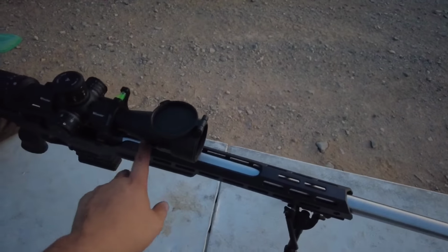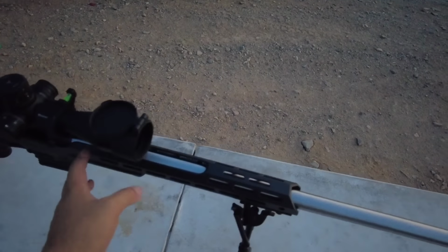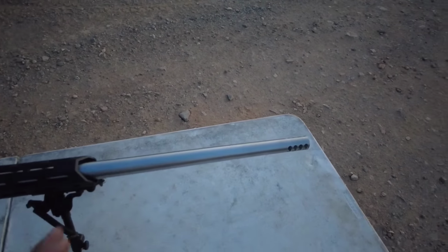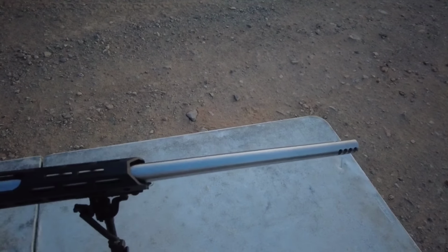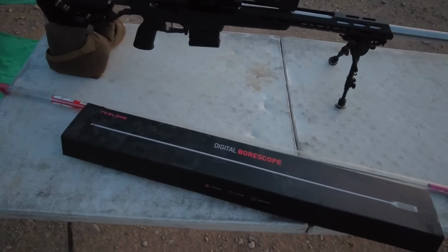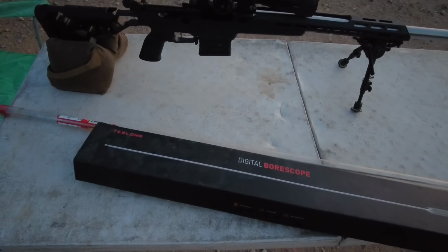So you should see a little bit of copper fouling within, obviously, the throat area when the bullet engages and lands. And then you should see copper fouling around three-quarters of the bore all the way out the muzzle. So if you see any other copper fouling in between, that's usually a tight spot or some scarring down the bore. So like I mentioned, a digital bore scope is an invaluable tool, highly recommend it. I'll put a link in the description below, check it out.